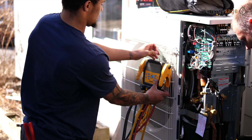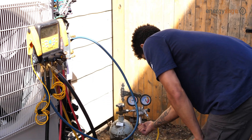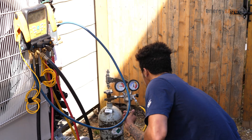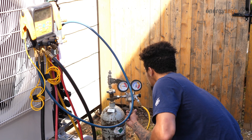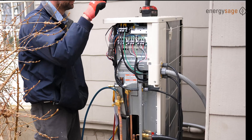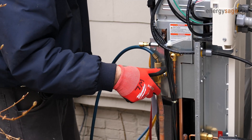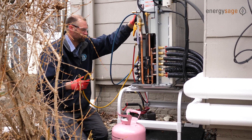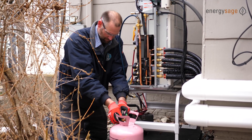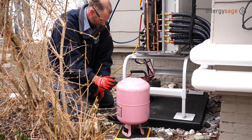Then comes the pressure test: hooking up measurement gauges to special ports on the outdoor unit, filling the refrigerant lines with nitrogen gas — chosen because it's safe and cheap — then leaving it overnight or at least a couple of hours. If the pressure holds steady, you've got an airtight system. This heat pump comes pre-charged with refrigerant. For the first outdoor unit, there was enough refrigerant that Wayne could just pop the seal and it was ready to run. The second outdoor unit had longer lines, so Wayne had to depressurize the line with a vacuum, then carefully add a few ounces of extra refrigerant using service lines, gauges, and a scale to measure everything out.